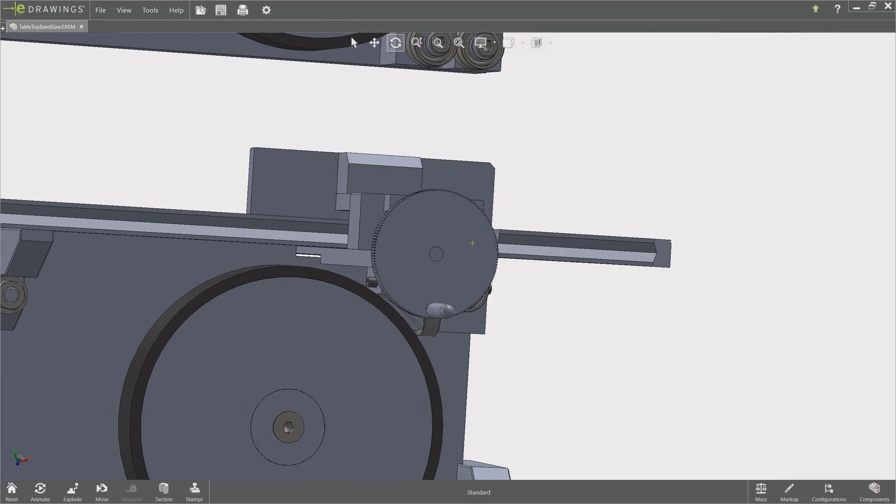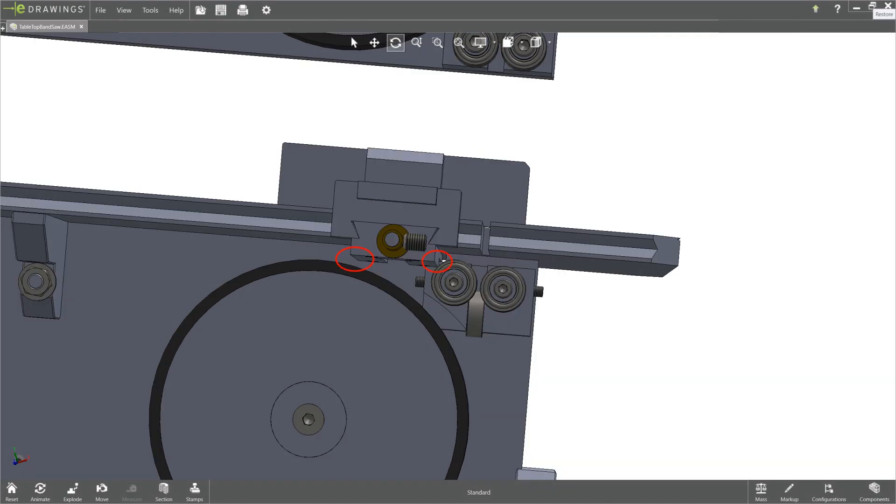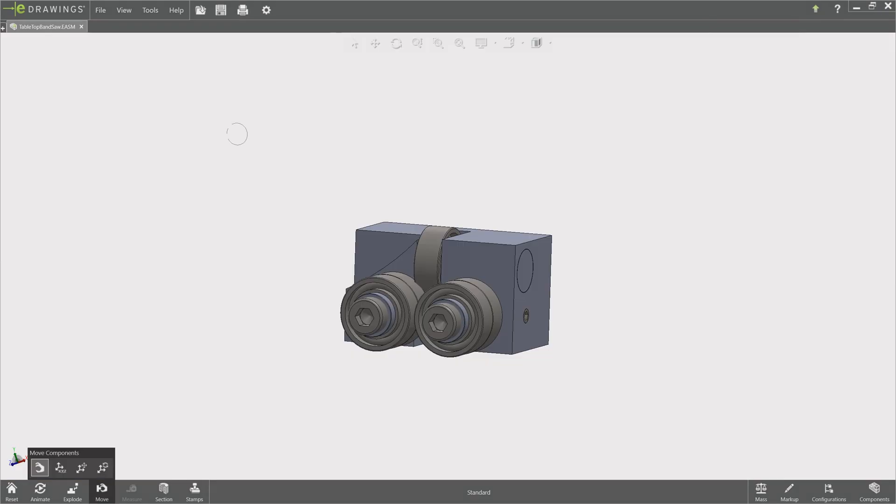John Wright also noted this in his video: the space between the right bottom wheel, the saw blade guide, and the bottom of the cross guide is very limited. It would probably be better to make the holes for the mounting of the motor gearbox a few millimeters lower — not too much, of course, because then you won't be able to get the saw onto the wheels.